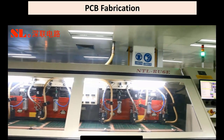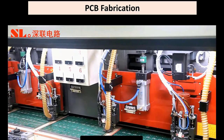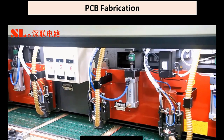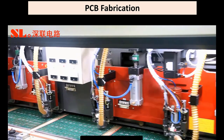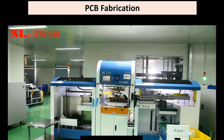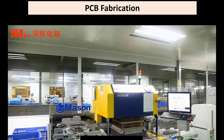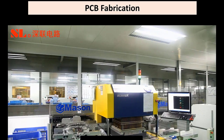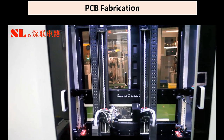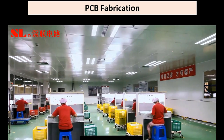As I talked about, the routing of the boards to remove the PCBs from the panelized assemblies. Customized material outlines using CNC router machines. All automated in this example. This electrical test inspects the opens and shorts of the finished PCBs. Make sure you got the continuity. Another version of that machine in a vertical, with flying probes on the top side and the bottom side.